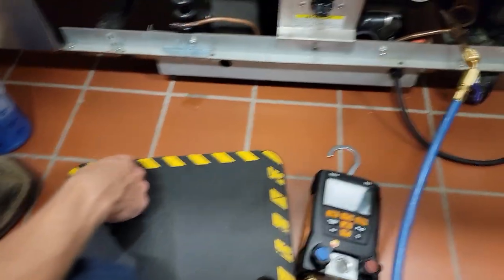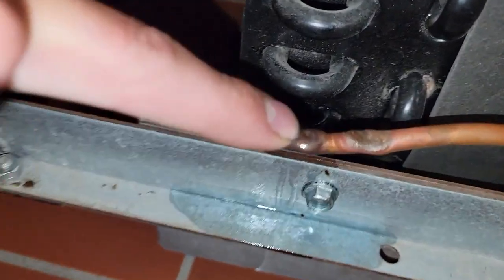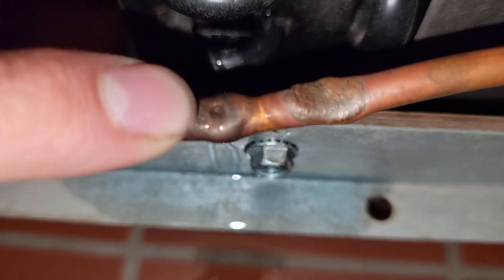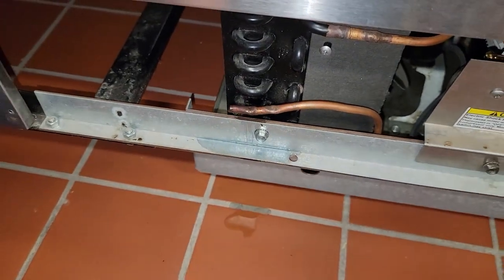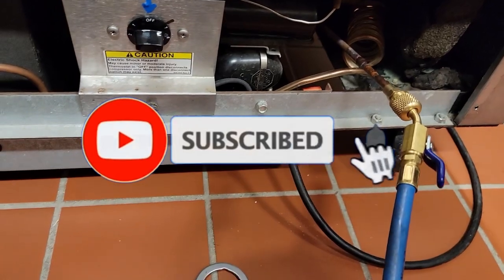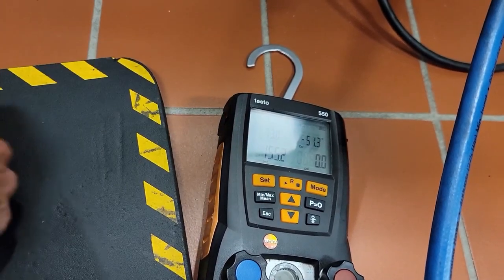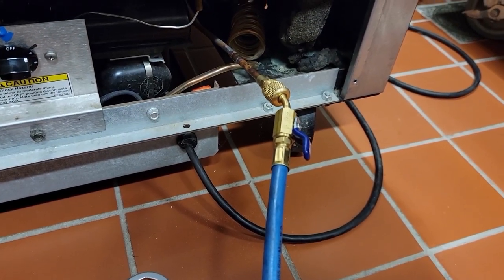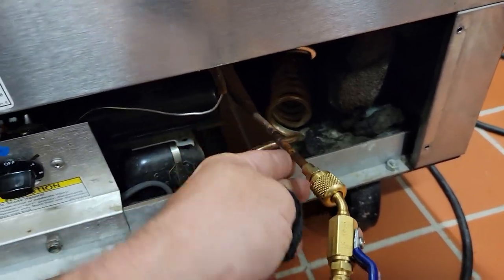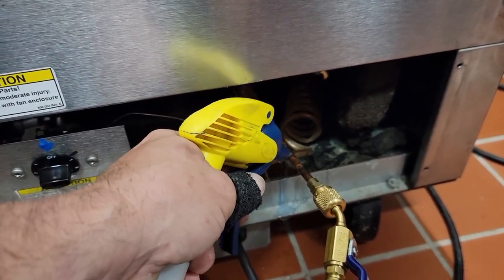My fingertip - looks like someone tried piercing it when I sprayed bubbles on there. Usually they crimp it back here too. Let's see - I don't think it's leaking that fast. It's at 125.2 and hasn't dropped a whole lot. Let's switch it to the high side and put the timer on it. Well, that's not going to work because we didn't put the Schrader core in there. Check your braze joint here. You've got like seven inches of braze on that thing, it should be all right.